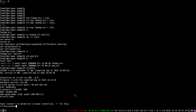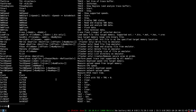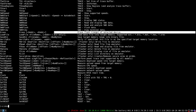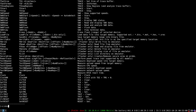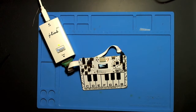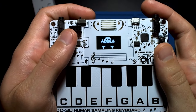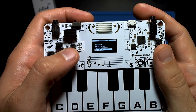We're going to go back into our debugger, connect, use the default device and speed, and now we're going to run another command called loadfile. You give it the filename of the firmware you want to load and then the address. We already know all those values, so we type: loadfile mod.bin, then the address 0x10000000. If all works it will tell me it's pushing the file to the device, and then we can go back over to the desk.